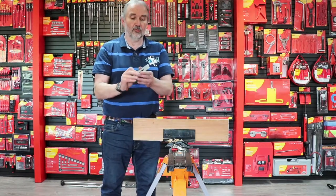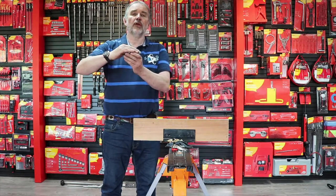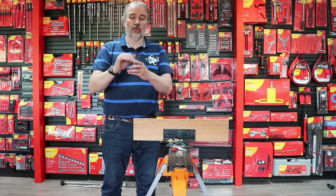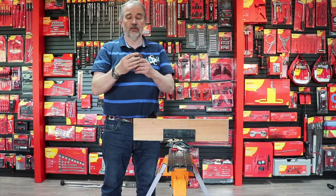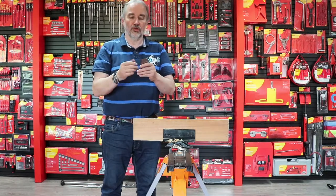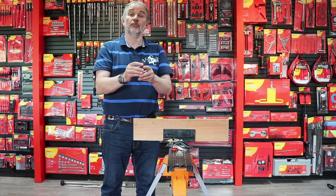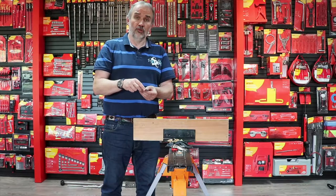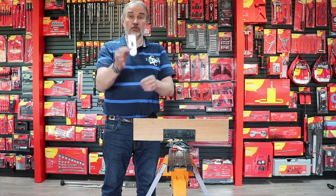The blade has an edge ground on it out of the pack at about 25 degrees. You want to make sure it's got no nick marks, hasn't been dropped, and is sharp. Remember it will cut, so don't run your thumb or finger across it — but it should be looking nice and level with a sharp edge. If it isn't sharp you need to sharpen it on an oilstone or a diamond sharpening block, but this one looks in quite good condition.